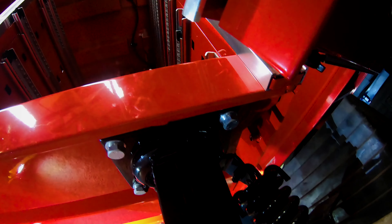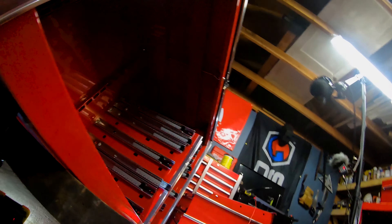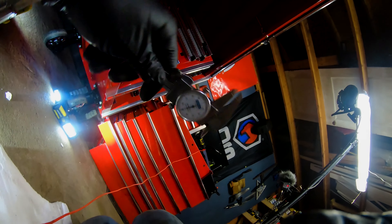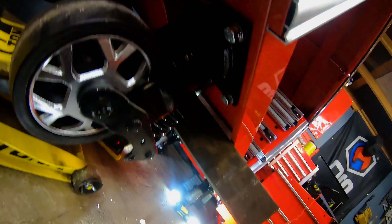I can get to a little piece of the channel and I'm going to measure how thick it is. This channel measures 151 thousandths thick — big thick channel, and it needs to be because this is the support of the toolbox. The frame design on this, as we can see, is different than the US General. I think we've seen enough of the interior and underside framing.